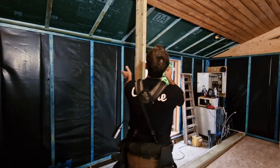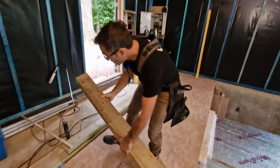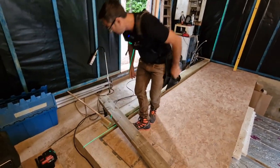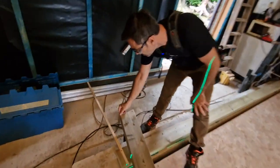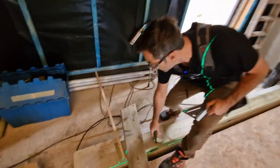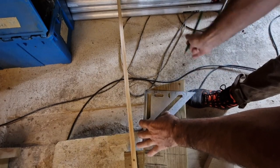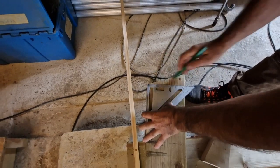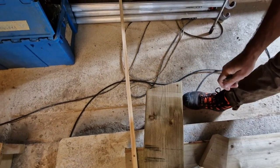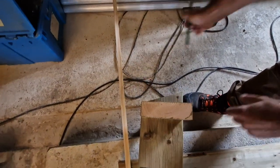Now what I'm going to do is we're going to make our wall square. So I'm going to adjust this stud, and I'm going to keep the top of the stud with the back of this cup. So we know that this is okay in the height. So what we're going to do is we're going to make the top of the wall to the highest, the back, if you like, there. And then we're obviously going to have our head, so one thickness of stud.